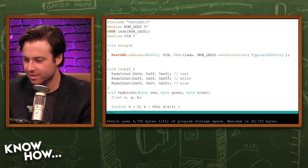All right, so I'm going to change my code here and see if it lights up. It should pop up here in a sec. I still see it flashing red. Let's see. Maybe I'll just... Ooh, it's hot. Okay, unplug that. It's hot. It's trying to draw power back through the UBEC. Really? Yeah. Should I plug it into the external power source? Give it external power. All right. External power.